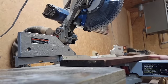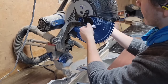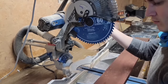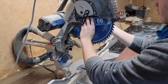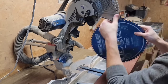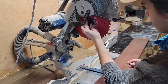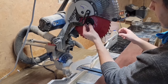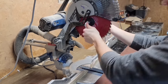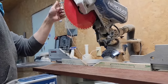For this next project I'm going to carve out some bowls and you're going to need a sliding miter saw for that. I don't think a normal miter saw will have the right features, but just about every sliding miter saw — cheap or expensive — is going to have the ability to do this. The first thing I'm doing is switching out my normal 12 inch blade for a 10 inch blade, which lets me cut a slightly deeper bowl. You could go even smaller for an even deeper bowl, but I think a 10 inch blade looks the best.